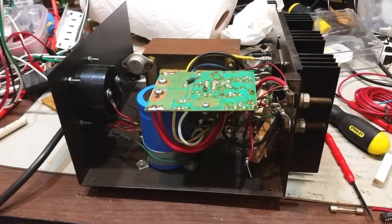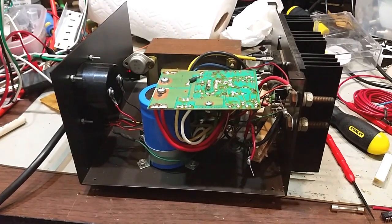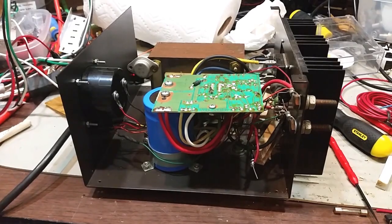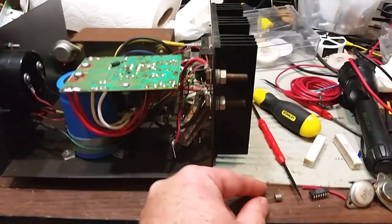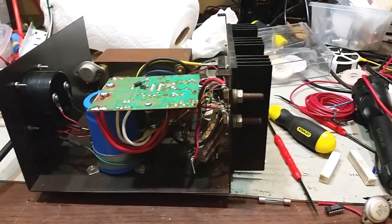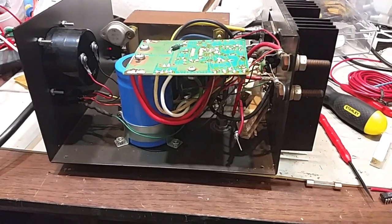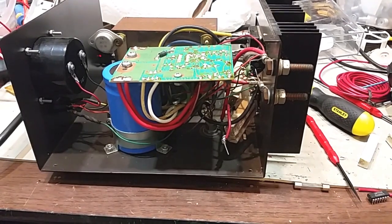If I was going to run it at 10 amps or so, I would also put in a smaller fuse — something like maybe a 4-amp or even a little bit smaller. I would venture to guess that if this had had a 4-amp fuse in it, the crowbar going off might not have instantaneously blown the fuse, but probably would have blown it within a matter of seconds.